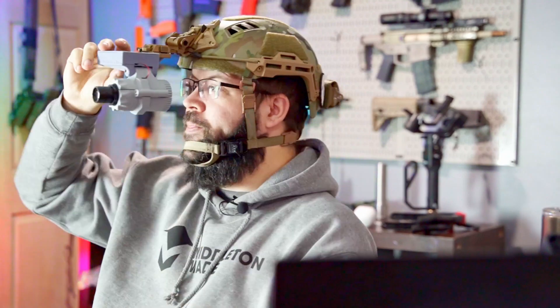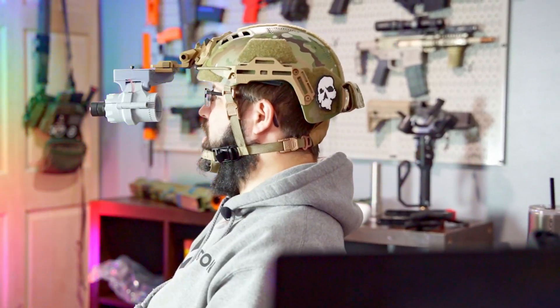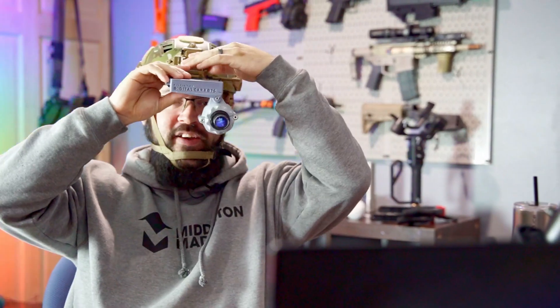My route was actually suggested by Danny Neapol: get a double convex 50mm lens, and if you get it appropriately distanced, you can enlarge the very small hole that the back of the intensifier tube has — it produces an image — and enlarge it to actually see better with your eyes. The issue I'm running into is the distance for it to actually be able to see is quite a bit more than I'd like. I want to have it half the distance, but I can't focus that close with my eye.